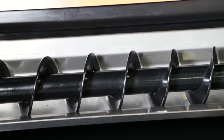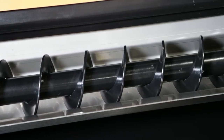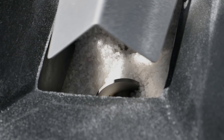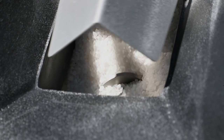Also of note, both augers have variable pitch flighting. This means the auger pulls the material faster at the exit to help prevent material jams and bridging. Plus, both auger models feature an auto-reverse that forces the auger to reverse to clear out jams.